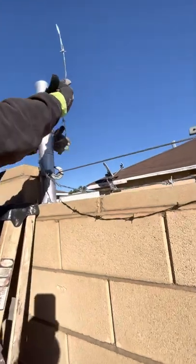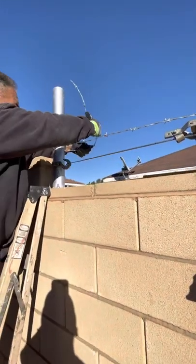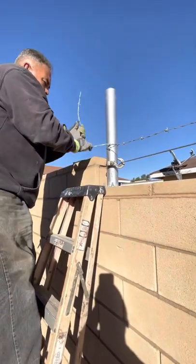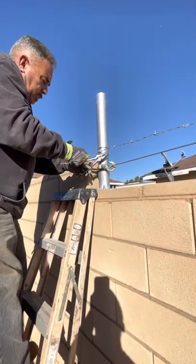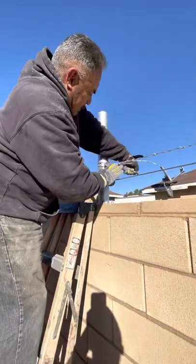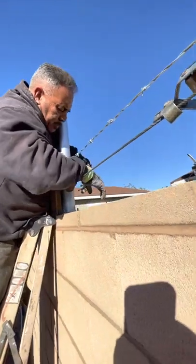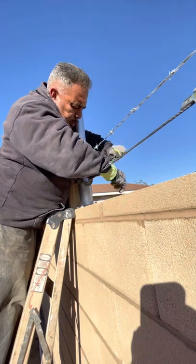Here's the same thing but this one — you gotta pull the slack out by hand. I'm gonna grab it here a little bit, give it a little snug. You wanna grab it underneath again, then go inside, take a nice good bite, hold on nice and tight. Push this down and give it a twist — pigtailed and it's stuck. Then you want to cut the extra off with your pliers.